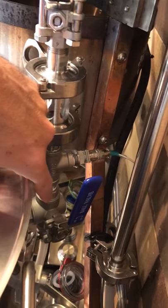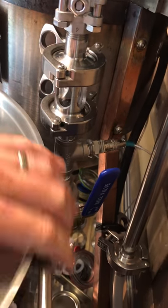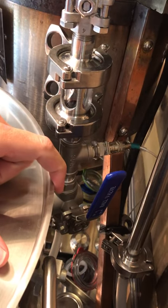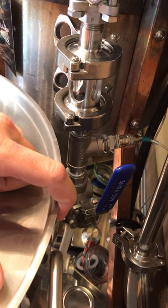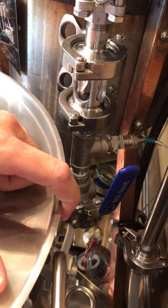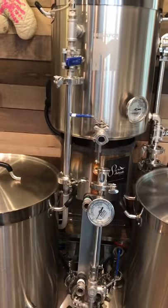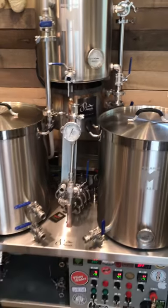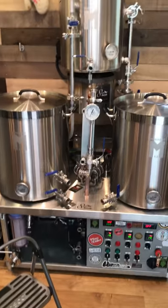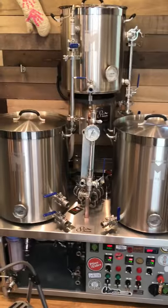I have a three-way valve down here. This is so I can go either into the mash tun or I can go to the sparge arm. It's an L-style three-way valve used with silicone hoses on the bottom for the actual sparge arm. You'll see the spools for the tri-clamp fittings — honestly just because I'm prissy, there's no real functionality. I eventually plan to hard pipe this all the way down to the pumps at the bottom. But really for now it's so that when everything's put away and we're not brewing, I don't see a bunch of hoses running everywhere.